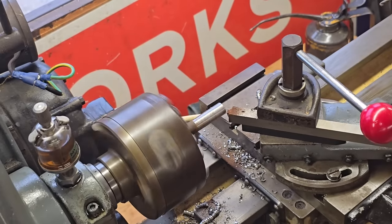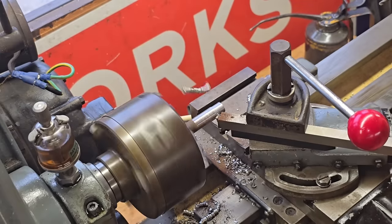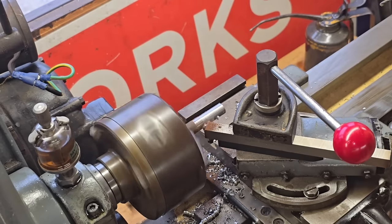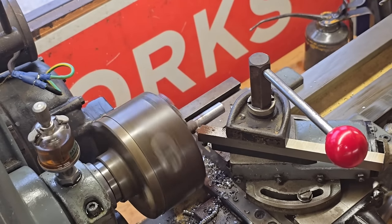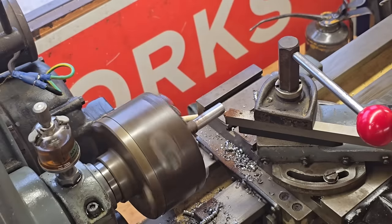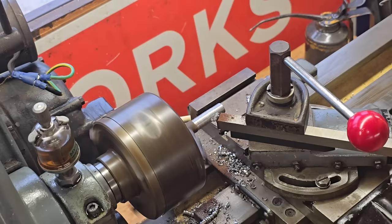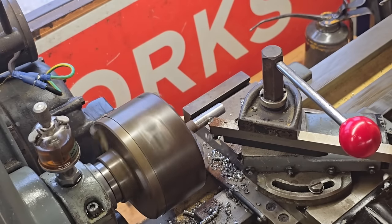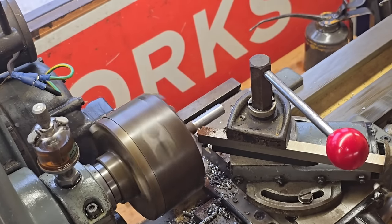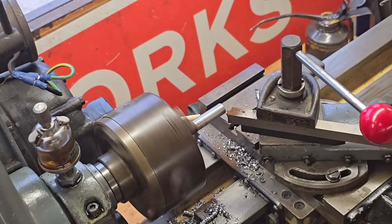Well, sorry if this is a bit boring, but I am thoroughly enjoying myself. Oh, we're cutting a big old cut now. I'm surprised that's nudging that awful. Oh, we're cutting the bolt off and over. There must be a wobble in that bolt because we're getting a dark spot. Now I'm not using power feed, I'm doing this on the little manual handle on the end. But I don't know whether I can cut on the back feed, I might try that in this round.